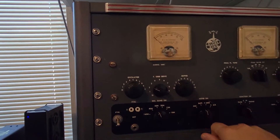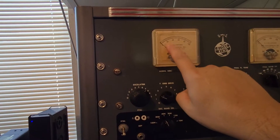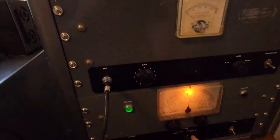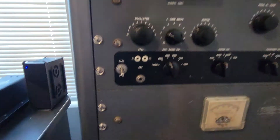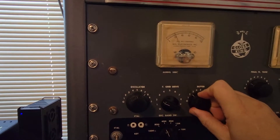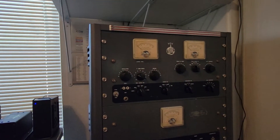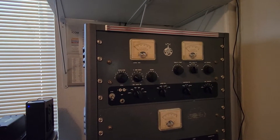Next in the chain is the buffer. Same thing — we've got a buffer tune here. We're going to watch the current on the meter, key it up on the exciter, and tune this buffer for a dip. That's a prominent dip — you can find that pretty easily. Go down and return that to operate. That's it; you've got the buffer tuned.